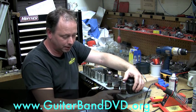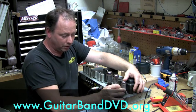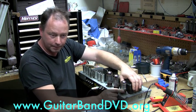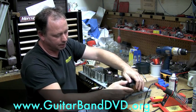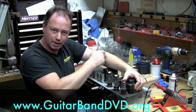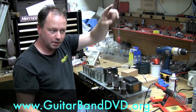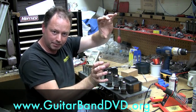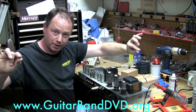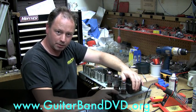They take AC power, the AC power travels through the tube, and the waveforms get rectified. That means they get put together into DC. Because the transformer takes it, raises the voltage, puts it through here, so then it gets rectified. Rectification means taking an AC signal. An AC signal is basically like a sine wave, the top half and the bottom half. That's how AC comes out the wall outlet, and turning it into a straight line, which is DC, direct current. AC, if you touch it, will knock you off.